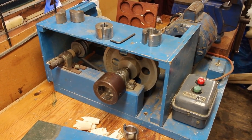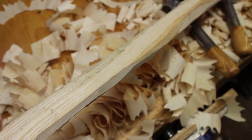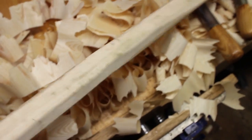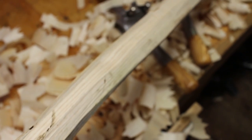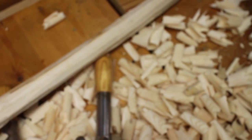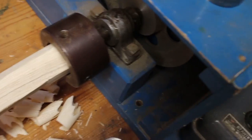Here I've got a riven piece of wood. By riven I mean I've just split it out with an axe, so the break has gone straight down the grain and you can follow the grain from one end right to the other — that's what makes chairs incredibly strong. I've split it out of a log and just draw-knifed it roughly to shape. It will be strong because the grain goes the whole way down. I'll pop the wood in the chuck using my thin little liner jaws.